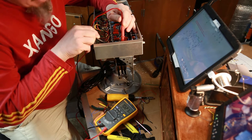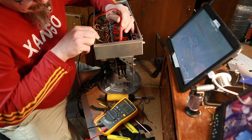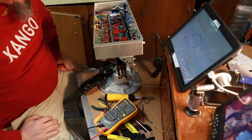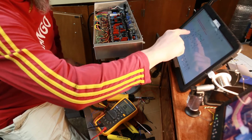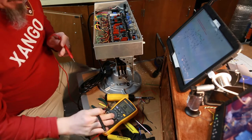I get exactly 1 meg. This next one over is also 1 meg. I'm just looking — okay, so I see a 1 meg over there and a 1 meg over there. In between those two are also a couple of capacitors, so I could switch this to capacitance mode.